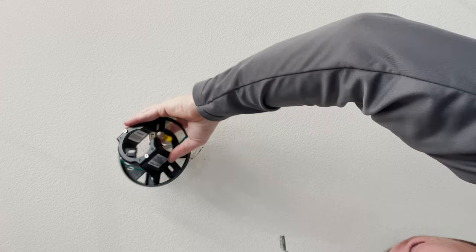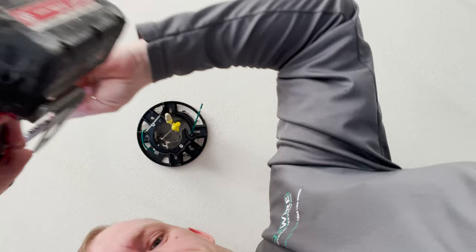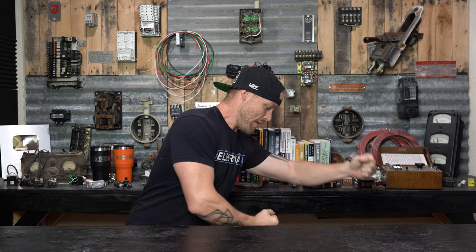The first thing I do is put the bracket up in the ceiling. I like to hang fans top-down, meaning I hang the fan and build everything in the ceiling in place — just like I would for a chandelier. I don't like trying to build stuff on the ground, especially fans. A lot of times they don't sit straight and pretty; if you put the blades on, they can end up leaning and you can warp the blades a bit. From the factory, how everything exists, I like not putting any stress on a fan. My method is much faster — going from the top and hanging everything, putting all the blades in place.